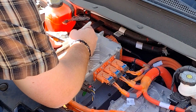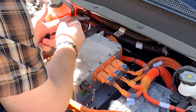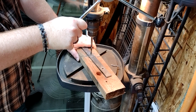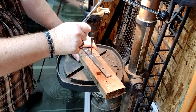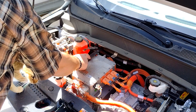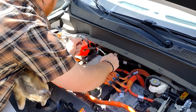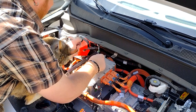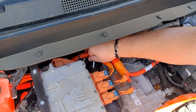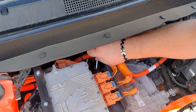After cutting the studs to length off camera, I marked where I needed to drill the holes for my bracket to fit, and then drilled them slightly oversized so I'd have a bit of wiggle room. The test fit was perfect — feline approved — and I tightened things down so I could line up my next piece. I then did the same thing with the bolt back here, except it's 8mm along with the one in front. Because I could only get metric threaded rod in short lengths, I had to use a coupling nut to put the two pieces together.